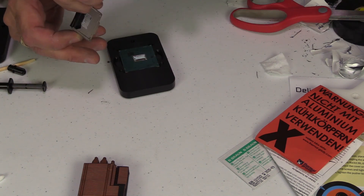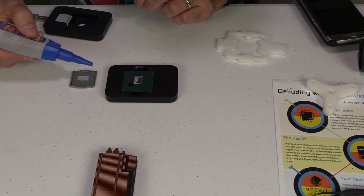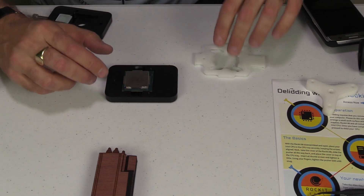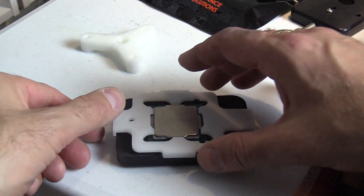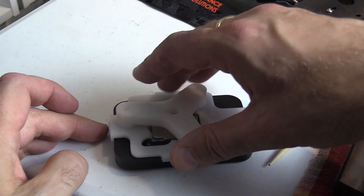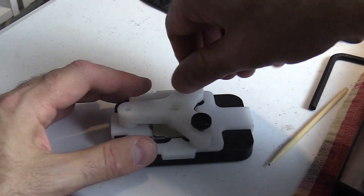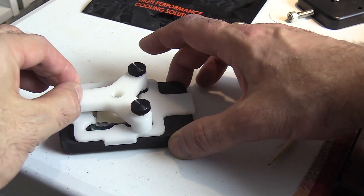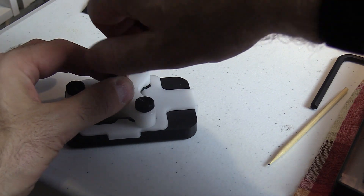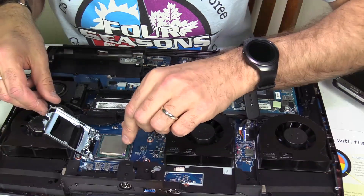Peel off the tape and you're ready to stick it back on. Apply some super glue to the corners of the underside of the integrated heat spreader, then carefully place it down on top of the die. The Rocket tool comes with a piece of plastic which you put over the heat spreader — that lines everything up nicely. Then using the other piece of plastic from the kit, screw in the three thumb screws. Then use the larger center thumb screw to put pressure on top of the heat spreader, and leave it to set for about five to ten minutes.